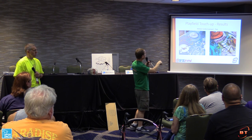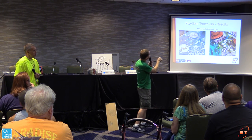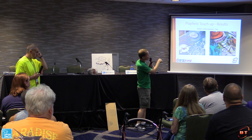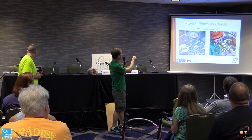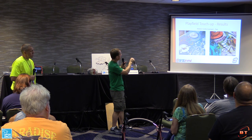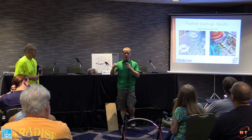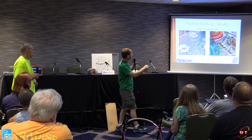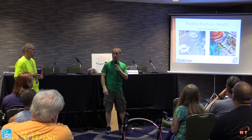So here is another example. This is the Addams Family again, in the graveyard. And this goes back to cleaning and knocking some paint loose. There's a little bare spot right there. What would happen is the ball would run back and forth between these two pops and started to wear a bare spot. Well, when I cleaned it, it was much larger than that. Back over here, I had to match the purple, and I had some of that purple down here too, which is not shown in that shot. See where this is missing down here, and there's a little missing out of the leg of the mausoleum. I reused that color and filled in these other spots, and then matched the black. Once you find a formula for the black that's on a game, that'll be the most common. If there's anything you're going to have to remix, it'll probably be that. And like I said, I can't draw a straight line with a ruler, and I had to put back several of those pickets and just make it as what it is. All right.